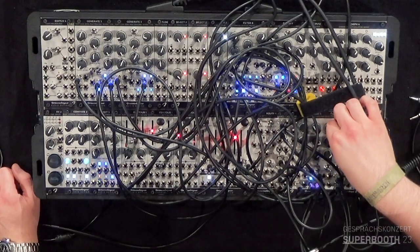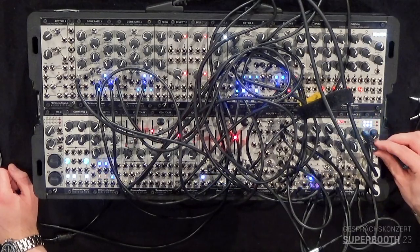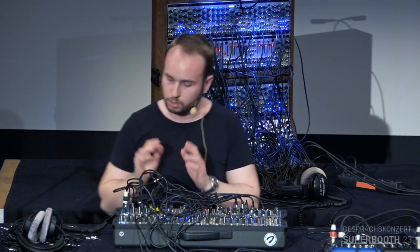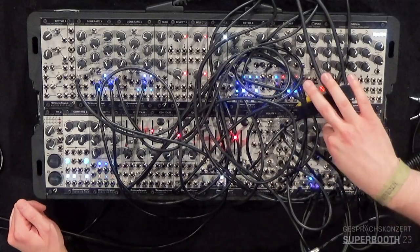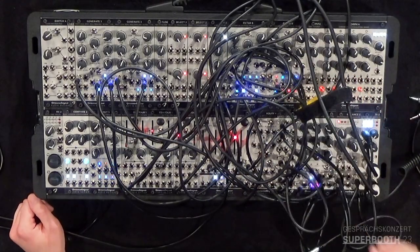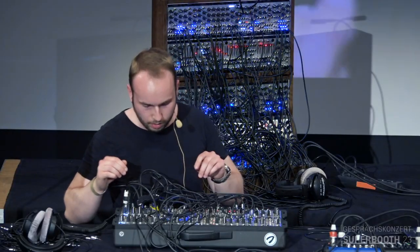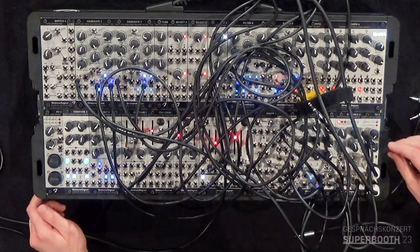What we've done with Delay One is focus on short delay times, but get the best possible fidelity out of them. So it's 1 to 50 milliseconds by default delay line, and it makes it really good at flanger effects, chorus effects, through-zero flanging, and it's got something to it that I think we don't get from existing BBD designs. Let me add some modulation here.